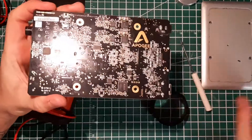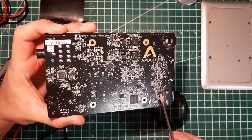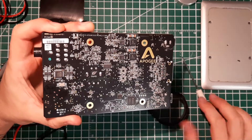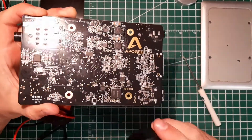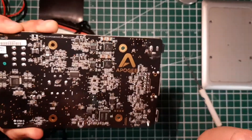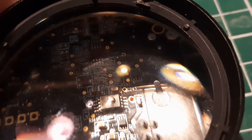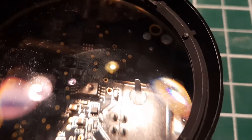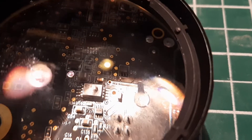After some analysis, I was right — this IC seems like it just exploded. The silicone casing is burned, and when you look with the magnifying glasses at a little bit of an angle, you can definitely see it was punctured from the inside — the smoke probably went out.